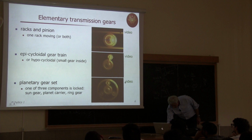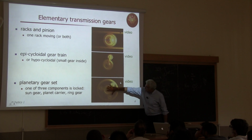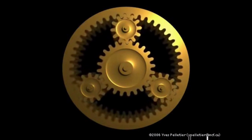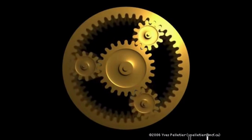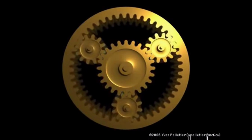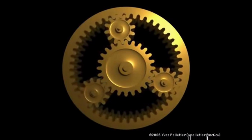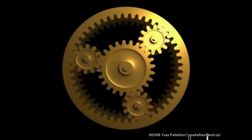So here, for instance, you see in the same video, 3 changing situations. Here, you see that the ring is moving, but these are fixed. Now the planet carrier is moving, and the sun gear is fixed. And finally, you fix the ring gear, and while rotating this, you see that everything is rotating with different speed. And counting the number of internal, external teeth, so the relative radius of these devices, you can come out with a number, which is the reduction ratio.